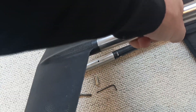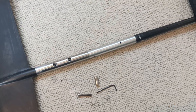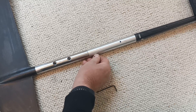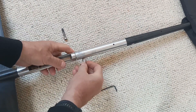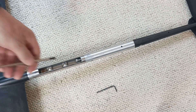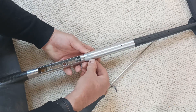To assemble this, once you make sure you've got it the right way up - I've got my stabilizer down, tips this way - you just slot it together. It's quite a loose fit to begin with, and then I'm going to put in my bolt and nut, and then flip it over. Then just do up your bolt, which goes into the back of the mast recess, and this is going to bring the two pieces together. You might find that you need to adjust it a little bit to do that.